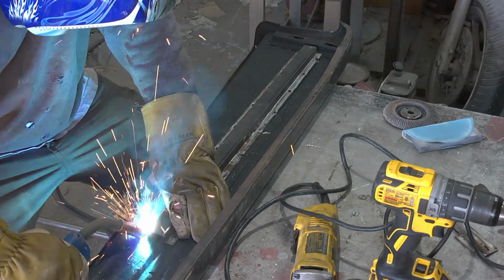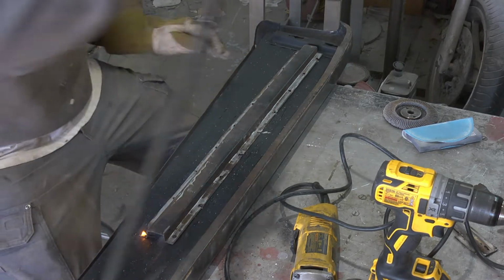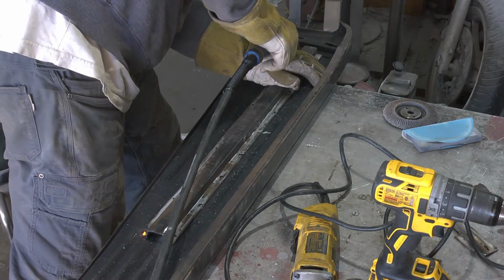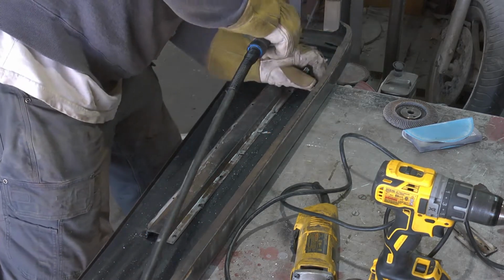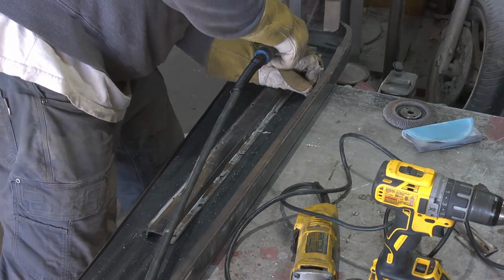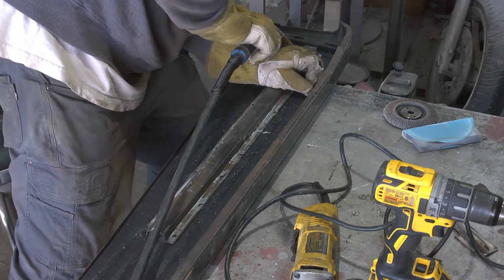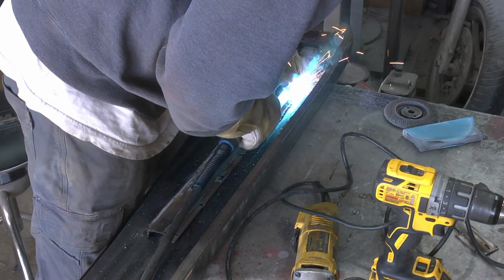Now, busy welding the brace back into place. Before I got to this point though, I went ahead and put a layer of fiber reinforced body filler used as a sealer over everything underneath that was rusted and rotten. Did it on the inside of that channel as well, and then painted everything a good layer of chassis black to create a nice durable surface.